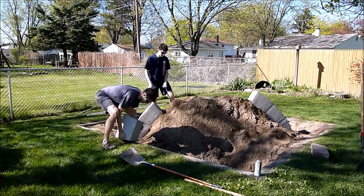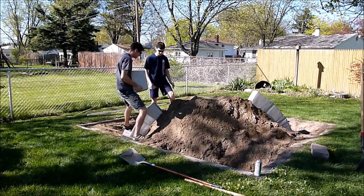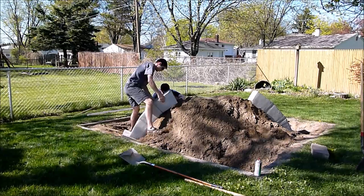Time to start assembling the arch. Obviously we needed some way to hold it up in the meantime, which is called centering. I didn't feel like building a great big wood contraption to keep everything up, so we just piled up the sand. Sand has the disadvantage of being very flexible and moving out of the way, but we piled it up pretty well.